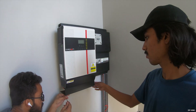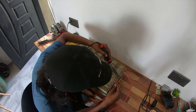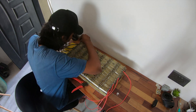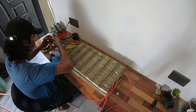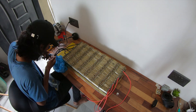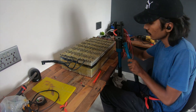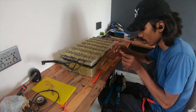Now it's time for the battery pack. We are going to use the same lithium-ion battery pack shown at the beginning of the video, but first we had to redo all the soldering. We're going to have two battery packs in total, each of which has seven packs in series, giving us a nominal voltage of around 24 volt DC from each pack. For more details, check out the Instructables article linked in the description. Compared to traditional liquid or gel batteries, these lithium-ion batteries not only last longer but are also more compact, so it's time to build wall-mounted enclosures for them.